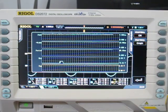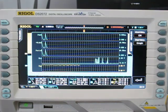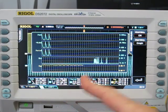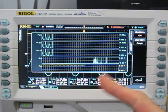That becomes especially interesting if, for example, let's say I start a sweep. Here I've started a logarithmic sweep heading into the scope, and you can see the graphing of the statistics of the fall time, width, period, minimum. This is fantastic, really fantastic.